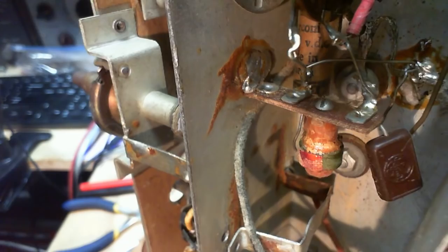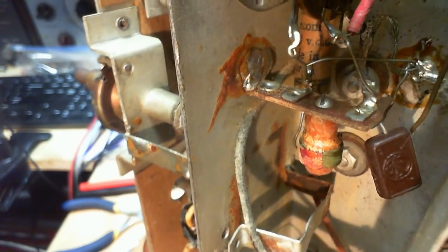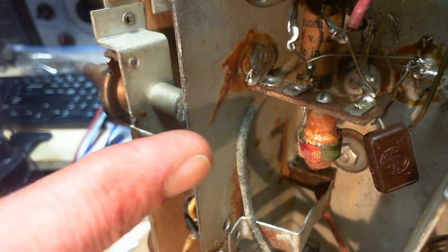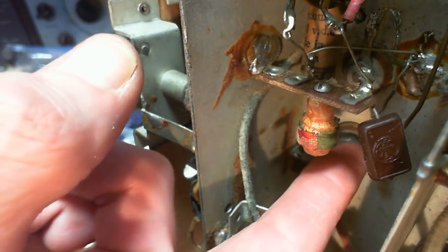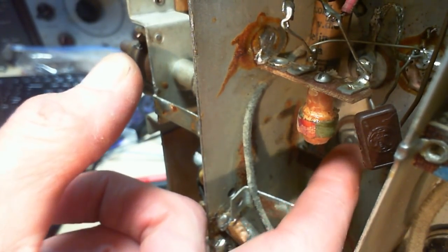Okay. The plan here. I don't know what the plan is. I could take those nuts off, washer them up, leave the grommets there. Once I get the nuts off, it shouldn't be too hard to change the grommets. I don't have this style of grommet. I don't have anything that would insulate the bolt going through the chassis. I don't have that style. So it's better to leave these in there if I can and just utilize what's left of them. Like, just washer it up, get the pressure and get this more steady. It's already a little more steady.